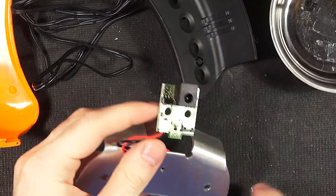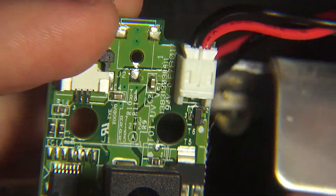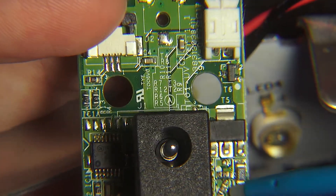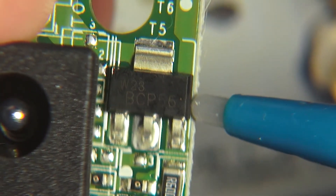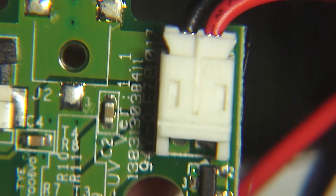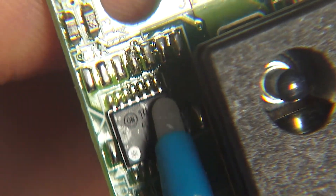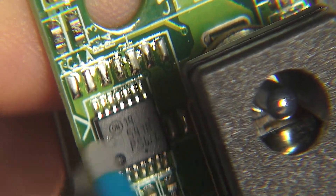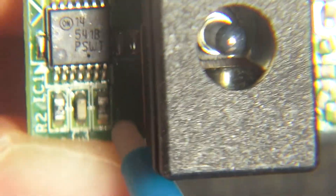The entire thing is driven by this small circuit board. The back has absolutely no components on it. The front has just a connector, main chip, several different passives, and oddly placed zero ohm resistors for jumper options. You can see how that one's in a weird angle. This must be our main driver chip — I would guess a MOSFET, but I will be corrected on that. Small, probably transistor drive with a MOSFET or similar. So this is our lead that goes out to the LEDs, and we can see our flat flex connector to the button. There are pads here for something. Down here is our main processor that does everything — they actually have footprints for two different package options, either the small tiny package or this larger package, maybe for more advanced features. And it's just run by a few little passives right by it.